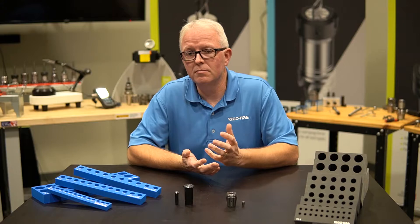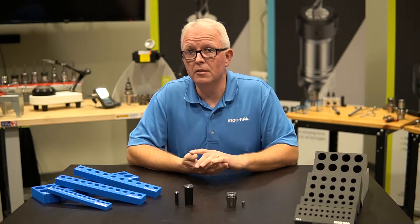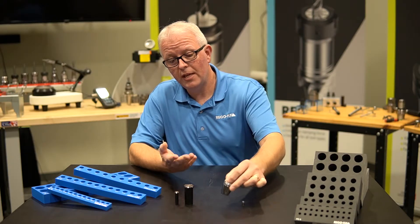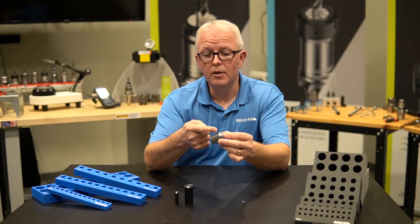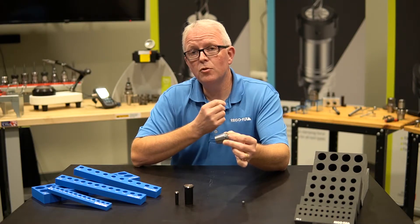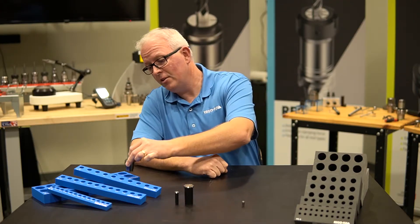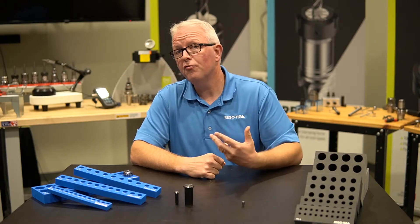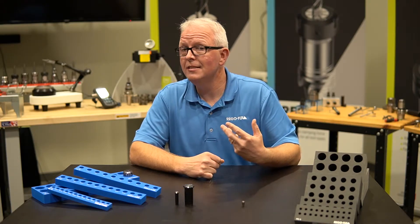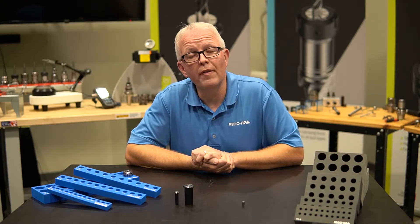What's the benefit to me? Well, it actually is a big deal. If you think about how your collet works — take this ER collet for example. This surface right here is the mating surface that goes inside of the tool holder. Well, that's also the surface that when I put it into my collet tray is fully protected. It keeps that surface from getting dented, dinged, or heaven forbid rust occurring on that surface.